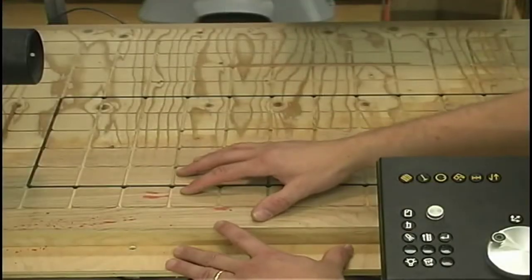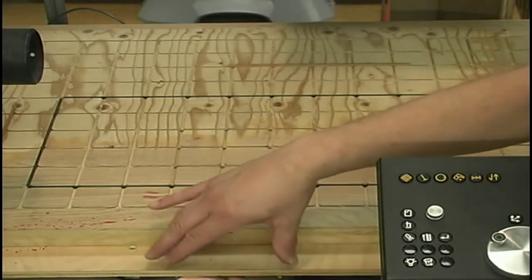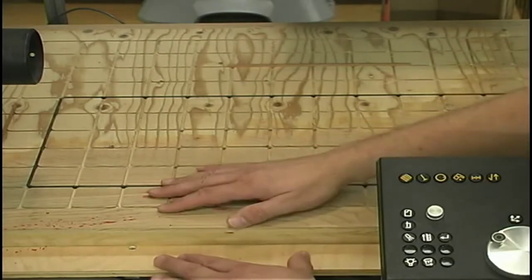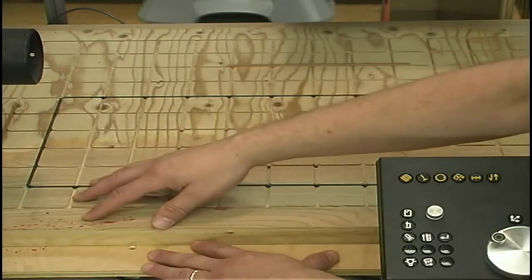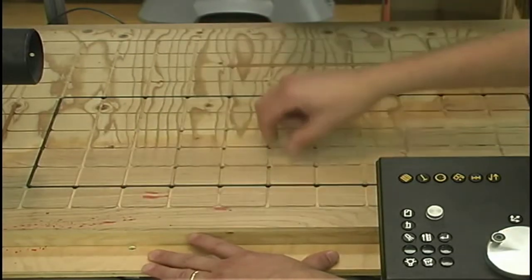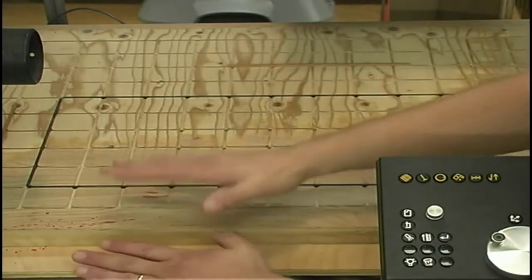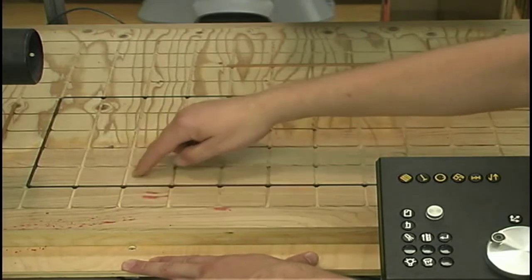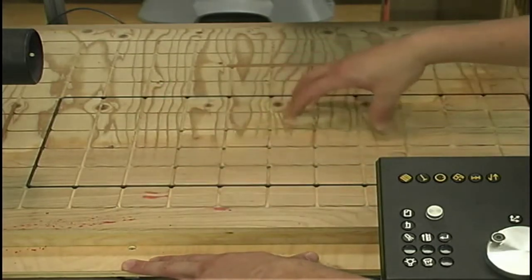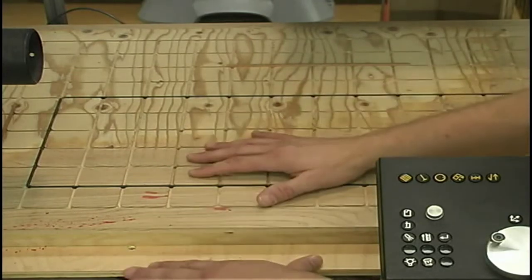The vacuum clamp table is actually a secondary table that bolts or attaches to the machine's main table. It's a hollow core constructed very much like a torsion box. There's a number of ribs going across, and then it's sandwiched two pieces of plywood top and bottom. Once it's on the machine, I wrote a program to machine these small squares at equal spacing, basically 2 inches apart. And that serves two purposes.